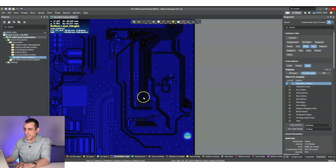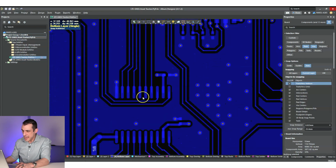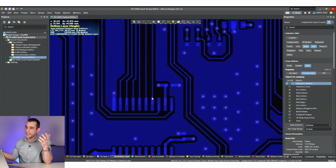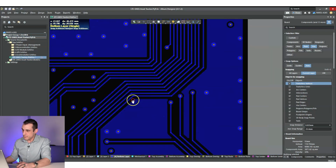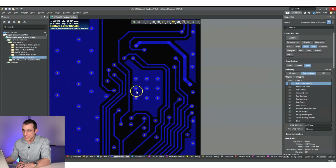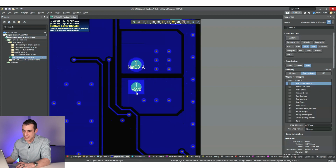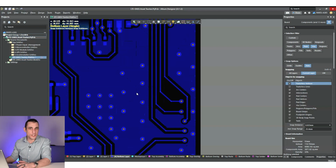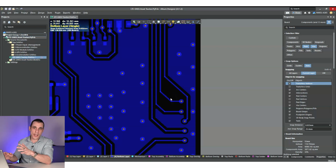What I'm looking at here is the bottom side, and the layout was re-engineered for another purpose, but I like it because it has the LTE transceiver in it, and it's got the GPS transceiver. So that's the main stuff that I wanted out of this project. We have a product that I want to make very high reliability. And you'll notice in this entire set of routes that I'm showing on the screen, I have no teardrops.